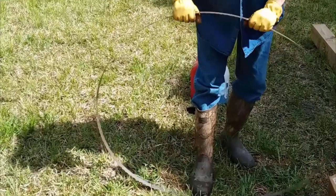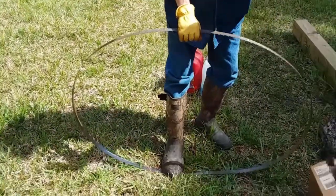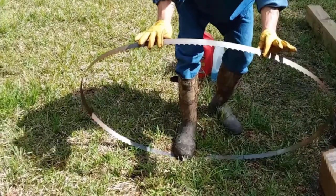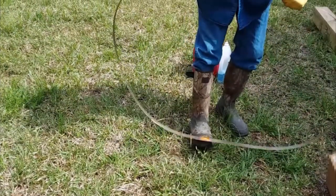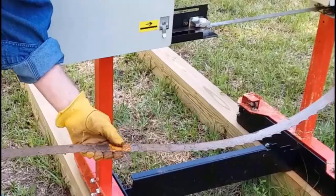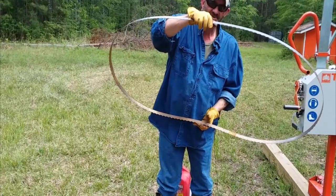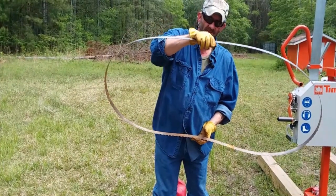Take the tip of your boot and put it right on there. Now the bandsaw blades are springy, so make sure you've got leather gloves on at a minimum. We're down here like this — just real light pressure. You can see how I just use my fingertips, flip it around, and it springs right into place. Now the lay pattern matches your sawmill and it's in a usable condition to be pulled through the wood.